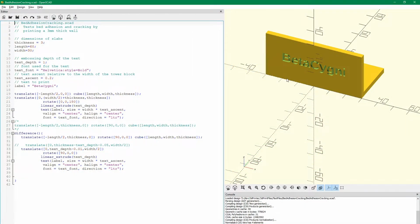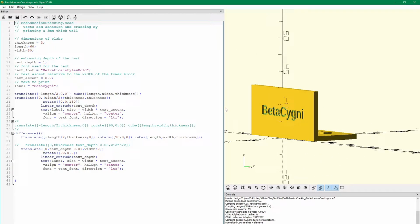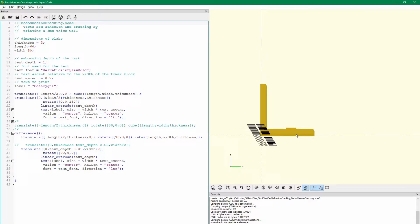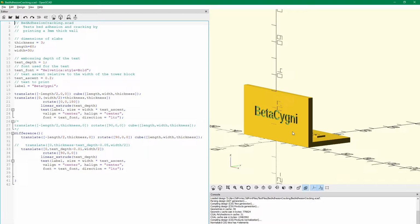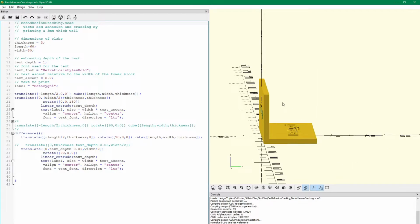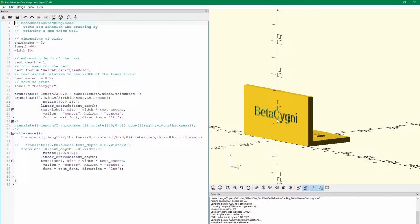So here's our bed adhesion and layer cracking test. This one again is on Thingiverse for free, and there's a link to it in the description. This is one I made up. So the bottom portion tests how well your corners are going to be adhering to the bed. So that tests how well you leveled it, and also the temperature difference between the extrusion and the bed temperature. And then the layer test is when it prints this vertical section. This is a bunch of layers that are fairly thin cross sections. So if your layer adhesion is bad, this will crack when you flex it. If you can flex it pretty hard and it doesn't crack, then you've got your layer adhesion dialed in. So that's a function of both your extrusion temperature and also your cooling.